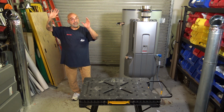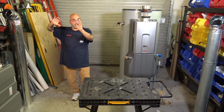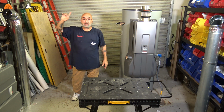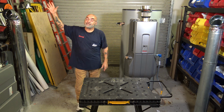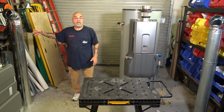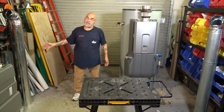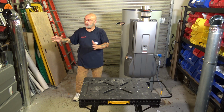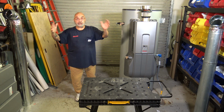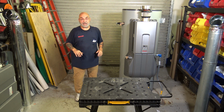So, remember, 6" minimum into a chimney. If it's in the chimney, make sure it's flush with the liner, not shoved all the way in and not back. If you're going into B-vent, if you could take the T off and put a Y, you can buy one, because you don't want to make a small Y. This is if you're cutting into a piece of pipe or you're going to be putting it in the box chimney. A Y is better than a T.